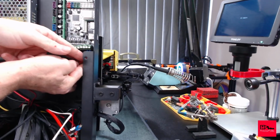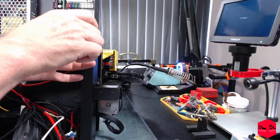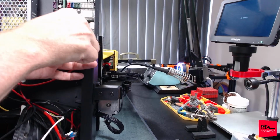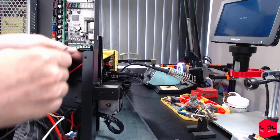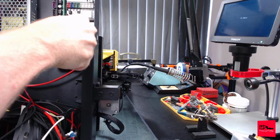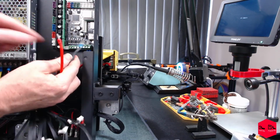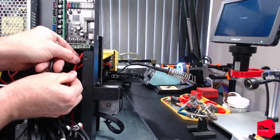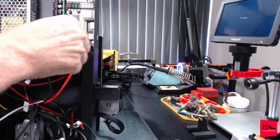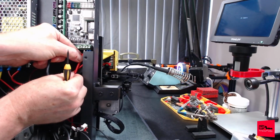Both of those appear to be in position. Hold them with one hand. Let's get them started. Just gotta get those a little over hand tight for now. Let's get our heat bed wires in. Nope, not backed out enough. There's positive to positive on this guy.